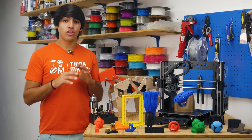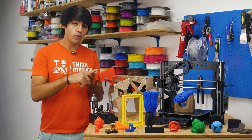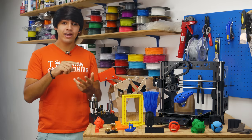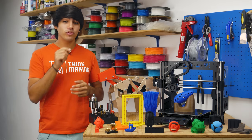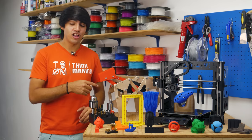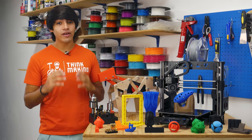So I think the prints look great. Surface finish is smooth, corners are sharp, steep overhangs are no problem due to the good cooling fan, and bed adhesion is amazing with that PEI sheet. My only failed prints have been those where I forgot to turn on supports in prints that needed them. Overall, the print quality is very, very good.